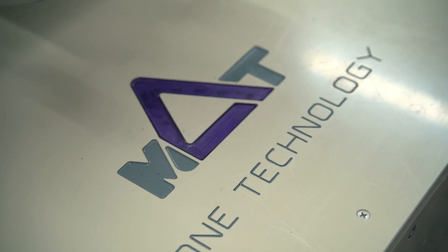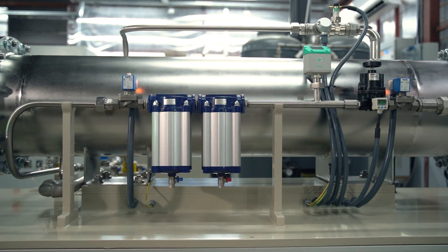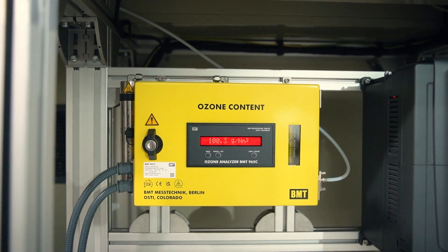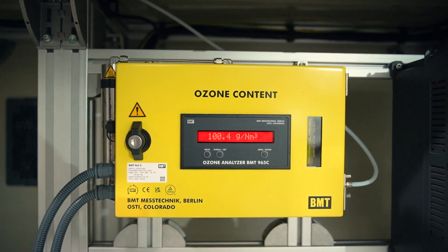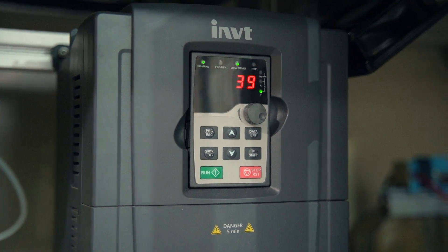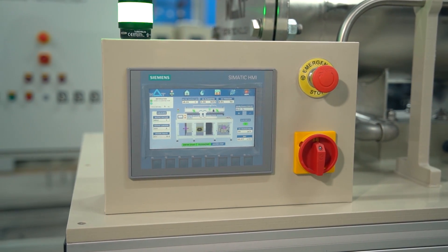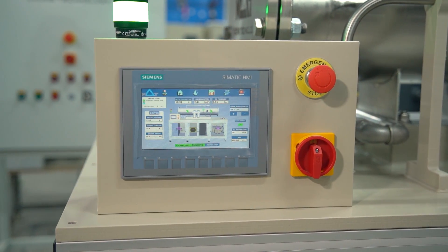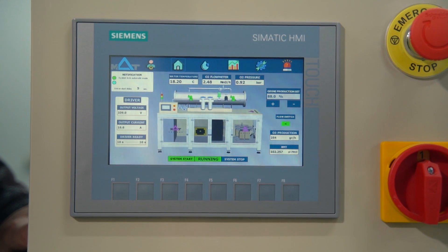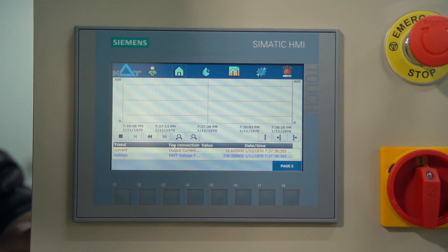The materials are fire retardant and heat resistant technopolymers; besides this we are using stainless steel and corrosion resistant coated aluminium frames. Inside the machine we have online ozone measurement systems where you can directly see which amount of ozone you are producing, variable frequency drives, and other components. Most importantly, the PLC unit and HMI unit connected to the PLC inform us about all details — pressure, flow, records, logs, adjustments, and passwords. This is also SCADA compatible, so you can use and monitor the machine remotely.